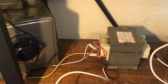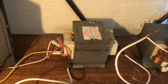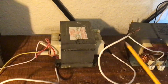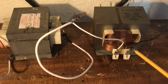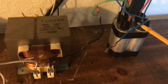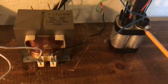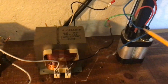So here's the basic circuit. Mains voltage enters from these leads to this first microwave oven transformer and that steps up the voltage to about 2400 volts. Then it exits from this lead over into the primary coil of this transformer here. This just acts as an inductor or as a ballast. That then exits from this coil all the way over to these two microwave oven capacitors. These are actually resonant capacitors, so this whole circuit resonates at the same frequency. Then that exits from this lead over to my arcing stick here.